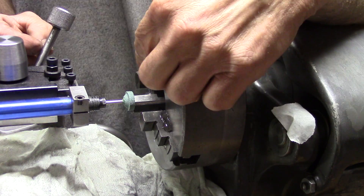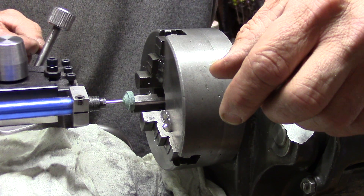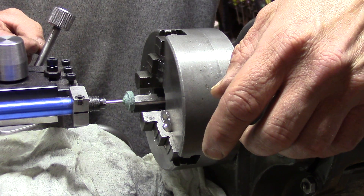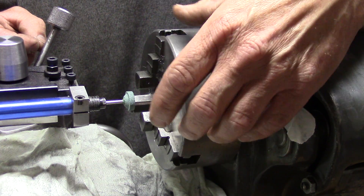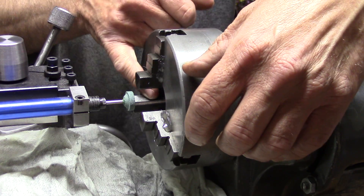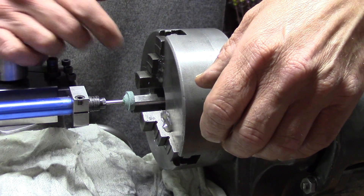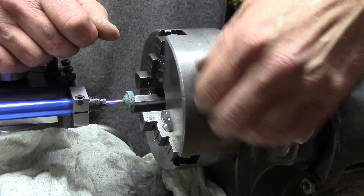But the jaws were extremely bell-mouthed and somebody in the past has had a crash — whether they hit it with a boring tool or were trying to turn a hardened piece of steel. When they cut into it, it flipped out of the chuck, jammed into the bit, and raised up burrs and took out chunks. The burrs were almost 20-25 thou high. It was kind of hard to measure with the bell-mouthing, so the chuck was almost useless.